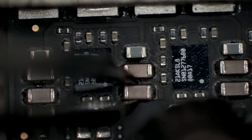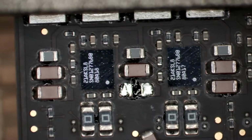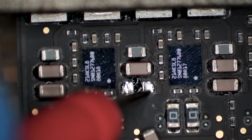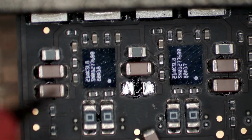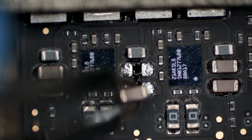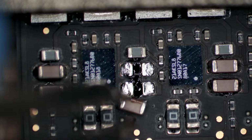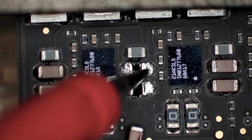Right. So this is contestant number 1. Let's see what the resistance on those pads are now. Okay, they'll be ground. And we're sitting at 22, so that's a hot value, which means this cap likely is not the faulty one. That's an open circuit, so it's not that one. Alright, contestant number 2. Again, you look pretty innocent actually. Okay, 24, so neither of those were actually the faulty ones.